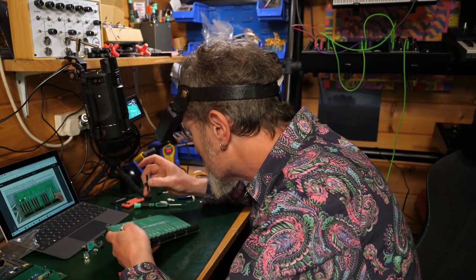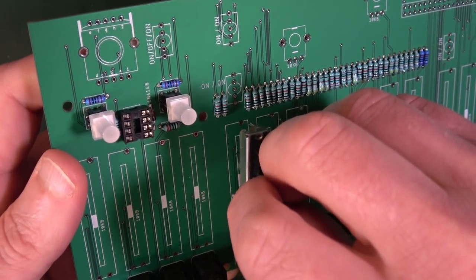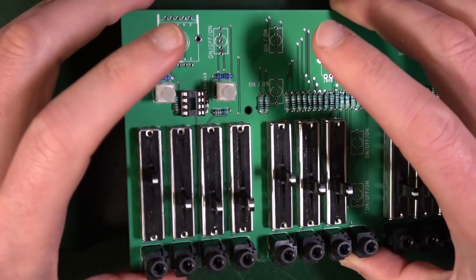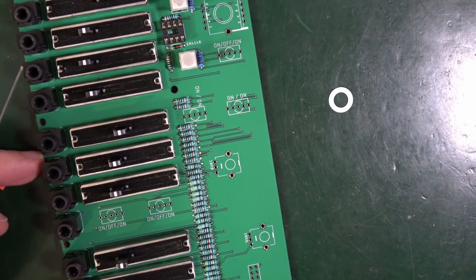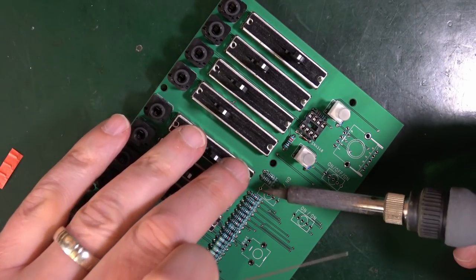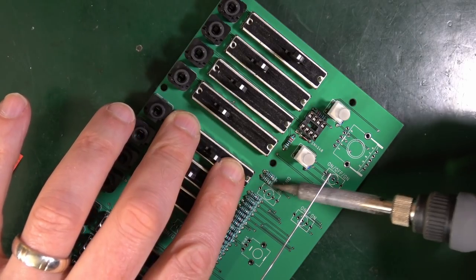So they've got two pins and one pin is what you've got. So they can only go one way around. They're all the same all the way across, are they? Yeah, they're all 10k. So they all need to be flat. Well, I'm going to take their advice and see whether I can actually solder this top pin. A little bit tricky. Access is tricky. But I guess if I put that in there, having it flat, so I add the solder, I'm just going to press it down before I release it.